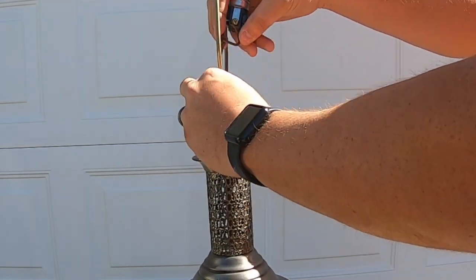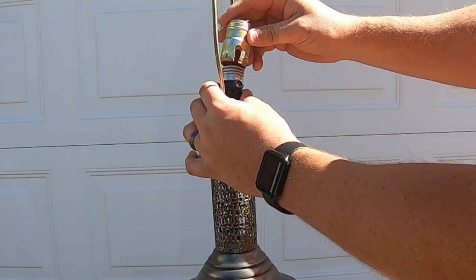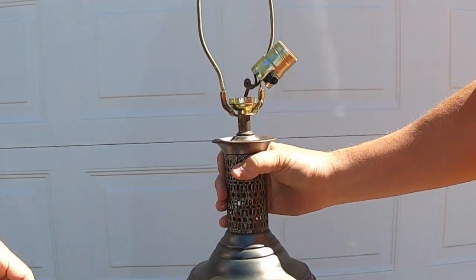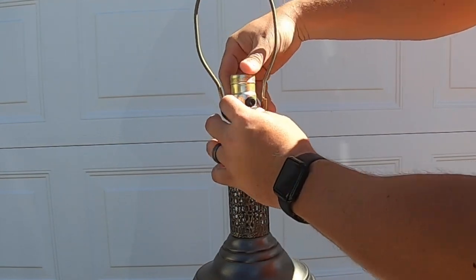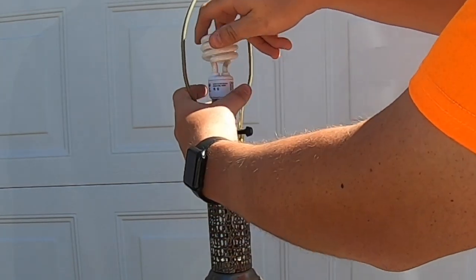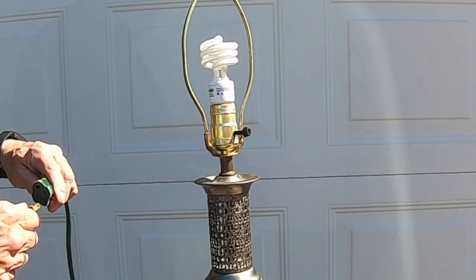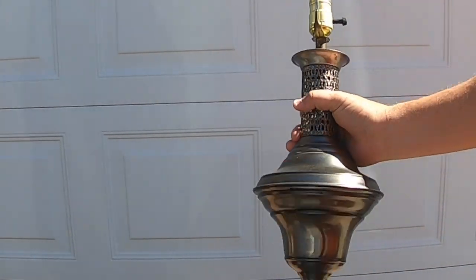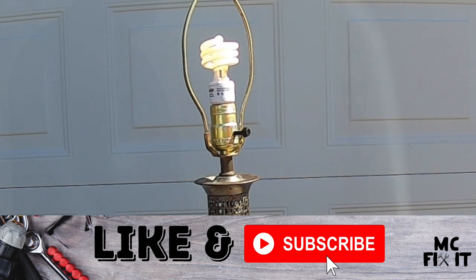Then go ahead and push it back, and you can even pull it through the bottom to get it nice and tight. Put the switch straight down on there just like that, then pull it from the bottom again to make sure it's seated down. The knot will stay in there and help lock it in — the directions tell you to push it down nice and tight. Make sure you seat that properly. Go ahead and put your new bulb in nice and tight, holding the knob as needed. Plug in your outlet and give it a test — and there we go, it works! Also remember to insert the pad back into the bottom. If this was helpful, please like and subscribe, and if you have any questions leave them in the comment section below.